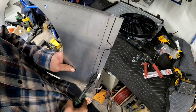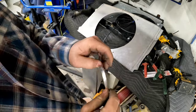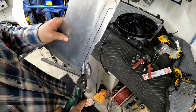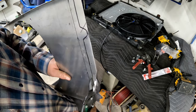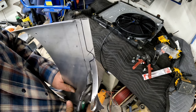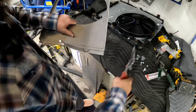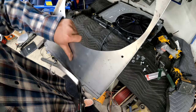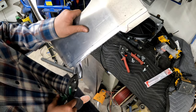Oh, that's a hot cut, baby. Ow, that thing's sharp. See the dimples? Yeah. Watch those sheet metal guys do it on Instagram and stuff, and they're smooth like that. So if you do it like this, and you just use half the blade, there's no indentation. Makes the finished result nicer. Learn something new every day, man. Hey, man, you could leave this in the video because you might teach somebody something they don't know. Yeah, I could.